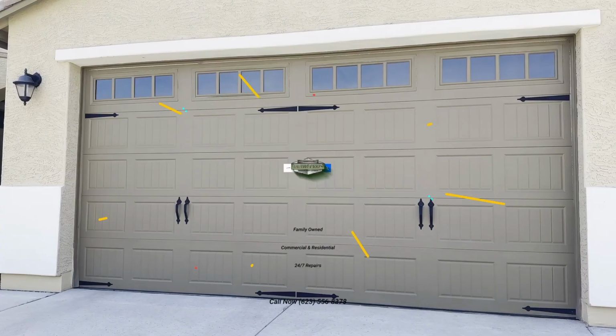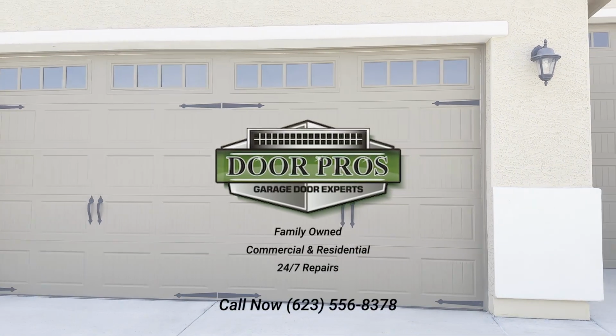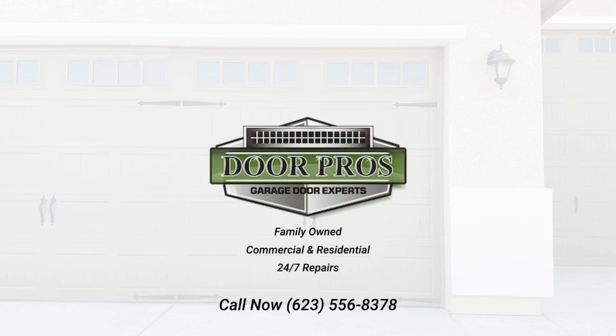Right now, it's not quite hot, and it's been a couple of days that the insulation has been in there, but what I've already noticed is that the temperature in the garage is moderating quite a bit more than before. I don't have these big heat sinks over here. We're only getting into the 80s right now, but the garage is already staying about 20 degrees cooler, in the low 60s as an overall temp. Next, I'm going to be digging into my walls all over the place and blowing cellulose into those, just like I did the attic, which is not going to be a small project, but adding the R21 or so value there is going to be huge. I really want to send a big thank you to William at Door Pros for helping me out on this project. I am going to need to replace the springs up there, which will be a later project.